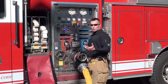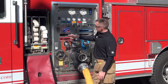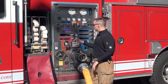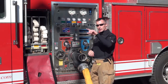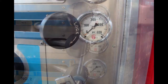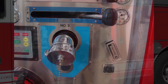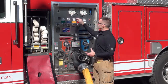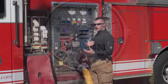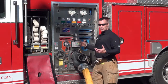With newer fire apparatus — apparatus built within the last 15 to 20 years — you will typically have some type of valve control, whether it be a push-pull linkage, a quarter-turn linkage, a screw linkage, or some kind of electronic valve. Electric valves will generally be located right next to the pressure gauge for that particular discharge line. It's important to realize that when operating with multiple lines, our master pump discharge gauge will always register the highest pressure we are pumping, and it's up to the pump operator to go back and gate down whatever cross-lay or valve configuration is needed.